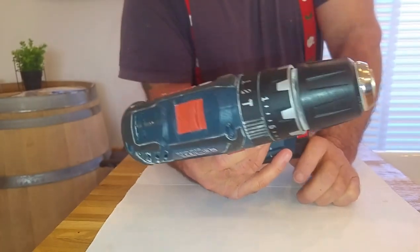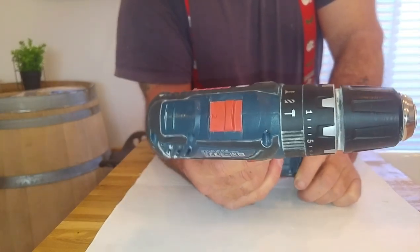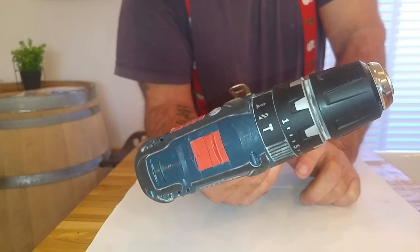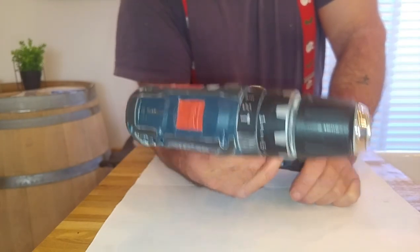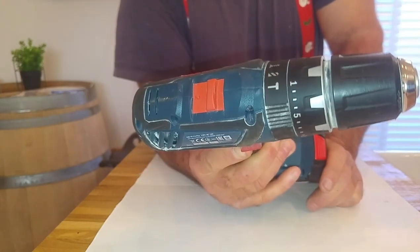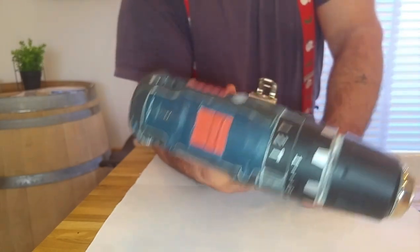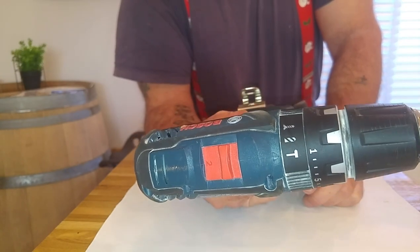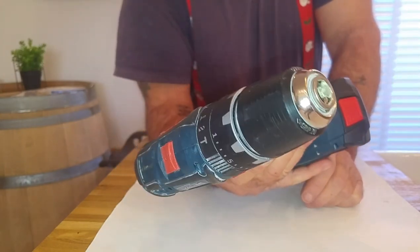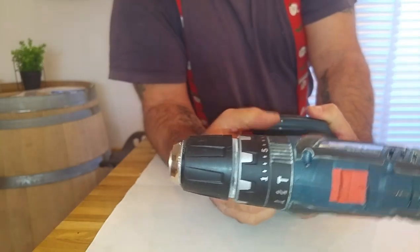It's been a really good drill. We've just put 273 metres of decking down on a job with it. The timber we used to raise the deck was 9 by 3 C16 timber, and we used 200mm screws through it all day long for two days. We then put a log sleeper wall at the front of the decking using 300 to 320mm coach bolt type sleeper screws, and we drove them through for a whole day. This drill did all of that on its own — I can't endorse this Bosch Professional enough.